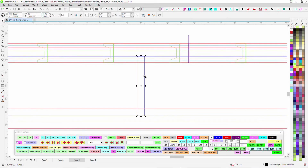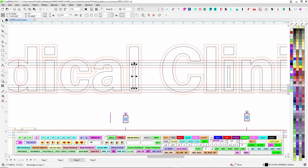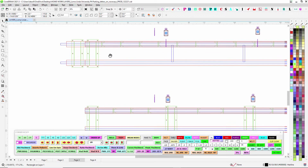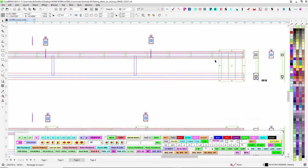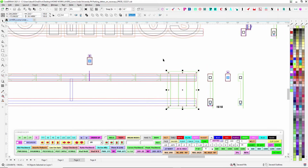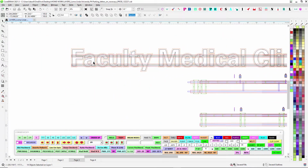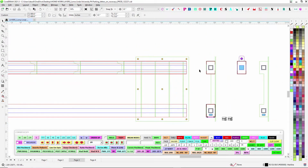And then for family, for the medical here, we can strategically run verticals behind like the L and the I here. And then that would connect the two. And so that way we can do that span with no problem whatsoever. Then the way I see it connecting to the plates, like I was saying, we make a plate that goes flat against the concrete. See, this is only 24 inches wide. You'd have a 36 inch wide post or whatever. But for the ends of this one, I'd like to beef it up where this hits here and this hits here. That would be sort of a 3-bolt kind of thing.